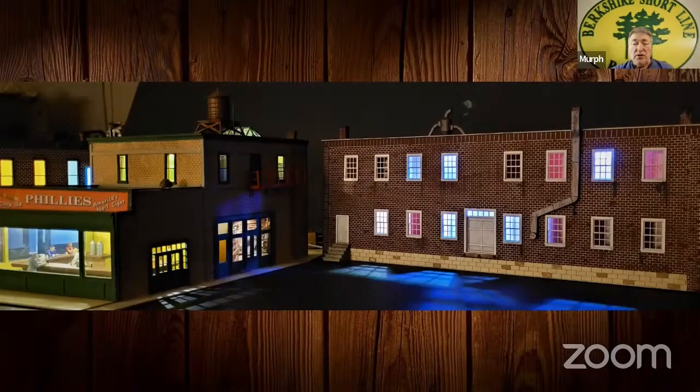Now, pixel number 2 is the next one down the daisy chain. But I want you to be red and blue, so you're going to be purple, and I want you at half intensity, and I want you to stay on for 30 seconds. And you keep going from pixel to pixel to pixel in this daisy chain.